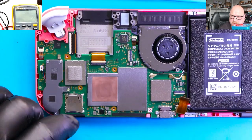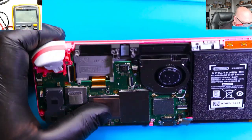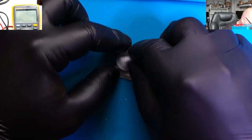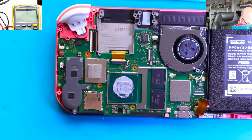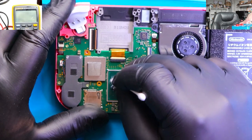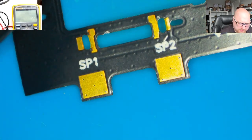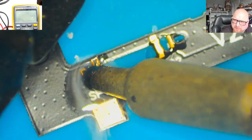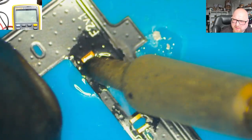We just need to remove that metal shield first, then install the ribbon tape on the APU and solder the jumper wire to it. I'll wiggle the shield a little bit — and that's it. I'm going to use the version 2 ribbon tape. First, I'll clean the residue of the thermal paste using a toothbrush to remove paste between the cups. Under the microscope, as I always do, I tin all the contacts on both sides to make it easier later. Soldering iron — let's tin them.